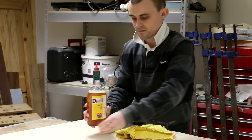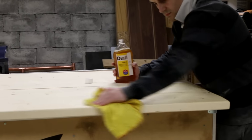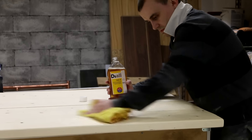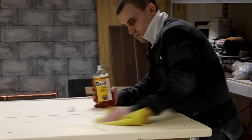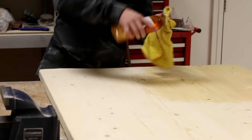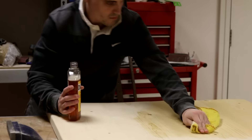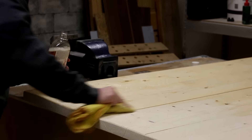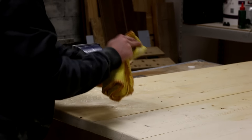There are a lot of different finishes I could have picked, but to stick with the rustic reclaimed look I decided to use some teak oil. It will soak into the wood and help protect it, but it will also allow the top to become worn and rustic looking over time. I've seen the technique of hitting the top with some metal chains or even keys to create little dents and give it an even more rustic look — there's loads you can do with this.